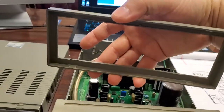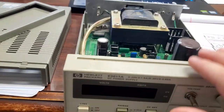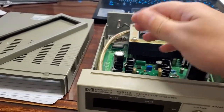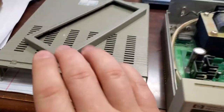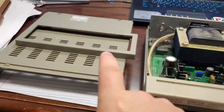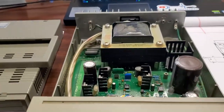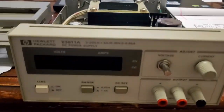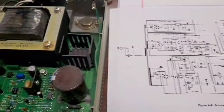One of the cool things about these old Hewlett-Packards is that they're all held together by press-on end caps. The front face is an end cap, and that is the rear end cap, and then there's the cover — they're all plastic, they just snap on. Use a flat blade screwdriver to pop them at the corners at these little indents — super easy. Compared to a lot of things, the plastic is not that fragile; at this age, a lot of polymers get brittle, but I'm not seeing it on this one. Either it's been very well taken care of, or Hewlett-Packard just made really good products.